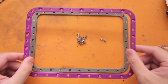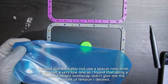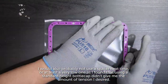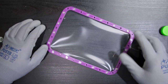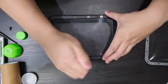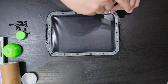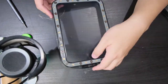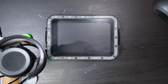When all heat inserts are installed, I move on to installing the FEP sheet in between my newly prepared frame. I actually made a little mistake here — I accidentally reversed the side of my nFEP sheet, so the rougher side became the print side, but I later rectified this off camera. The FEP sheet I'm using measures about 235mm by 160mm. After I was done, I tried to tune the tension of the FEP sheet to about 320Hz, but only managed to reach about 280Hz at maximum tension. However, the FEP tension didn't really negatively impact my ability to print properly, so I wouldn't put too much importance into trying to get it perfectly taut.